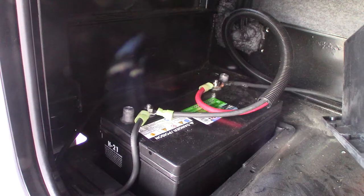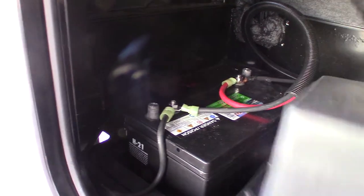The lids are still off, but you've got two batteries — 27-series deep-cycle marine batteries wired together as 12 volts. So you're just doubling the storage capacity while staying at 12 volts.